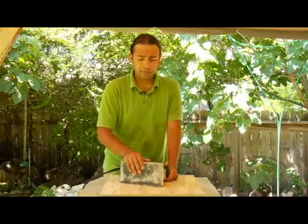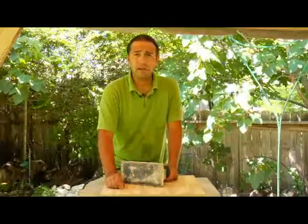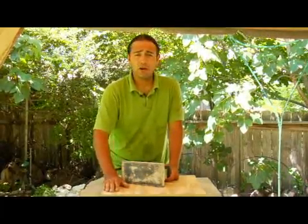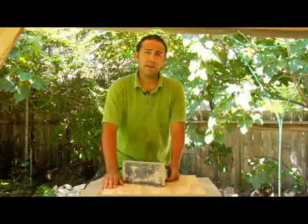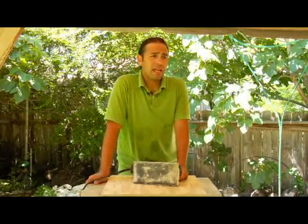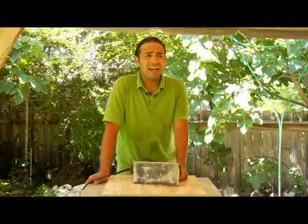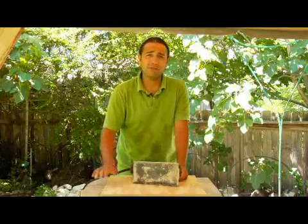220 is used for finishing, and that will get the wood really, really smooth and perfect for stains or shellacs or things of that nature. You don't have to go very high for paint, for instance. I would recommend maybe 100, 150 max for wood that you want to sand for if you're just going to paint it.